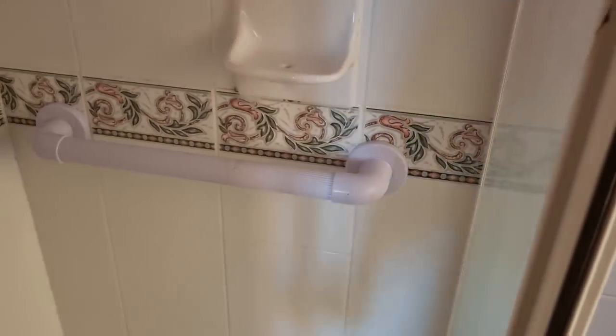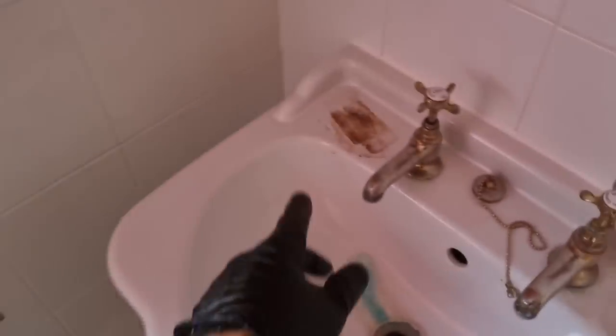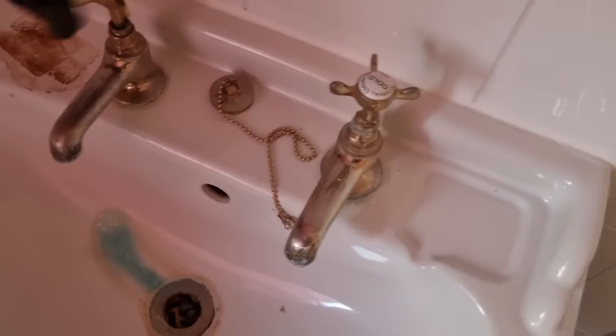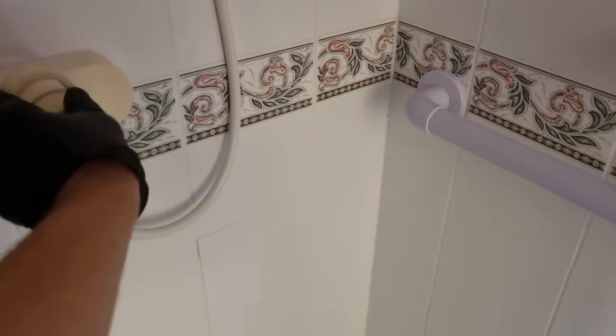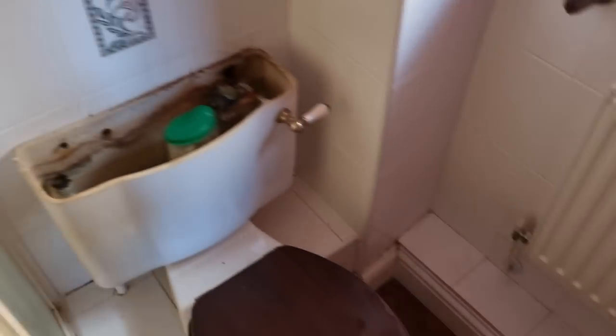All right, I've just turned all the water off. It's on a mega flow unvented cylinder just the other side of that. So when you turn the cold off, it should drain all the hot as well. We've opened the kitchen tap downstairs. All this lot should be emptying, so it should be good just to rip everything out, put valves on it, and then we'll have a look at sort of the pipework.